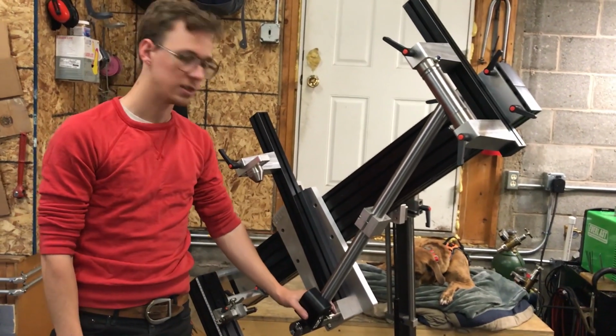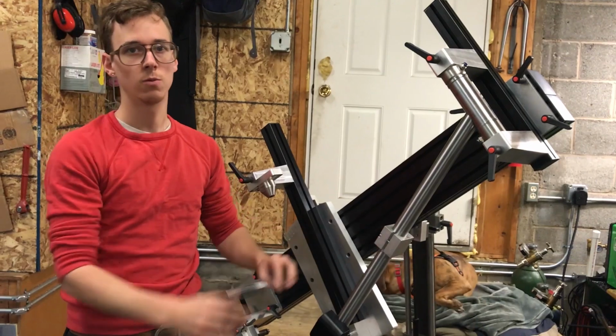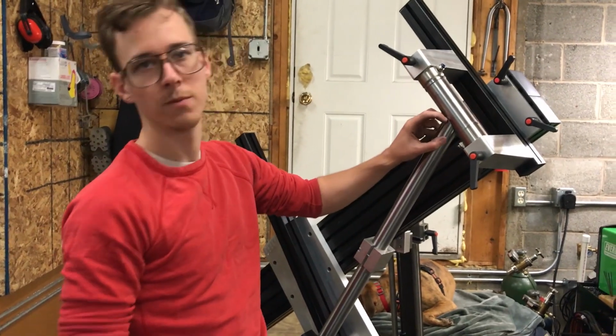I'm gonna get rid of this tool from here, and then I'm gonna bring it in closer with the hand file at the bench there, and I'm just gonna touch it up, check it, find the tight spot. You just kind of look around the circumference of the miter and see where it looks tight and where there's a gap, and then you remove material until it goes in the direction that you want.